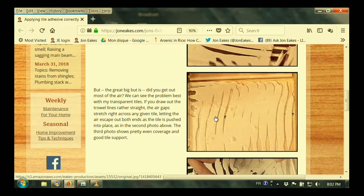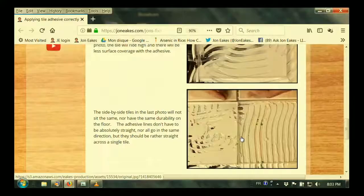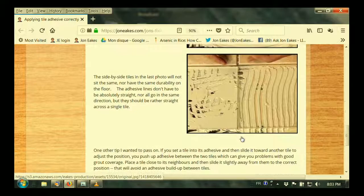Here's the problem: this is a really good tile pushed in and you can see the adhesive has spread out to almost the whole area — excellent adhesion. But here, we put the adhesive on in swirls and you see all kinds of air pockets that won't let the air out, so the adhesive doesn't go down properly — it can even bounce back up. If you draw the adhesive in straight lines the air never gets stuck and escapes out the edge of the tile. With swirls, the air gets trapped and the tile wants to be springy or shifts later because compressed air is trapped below.